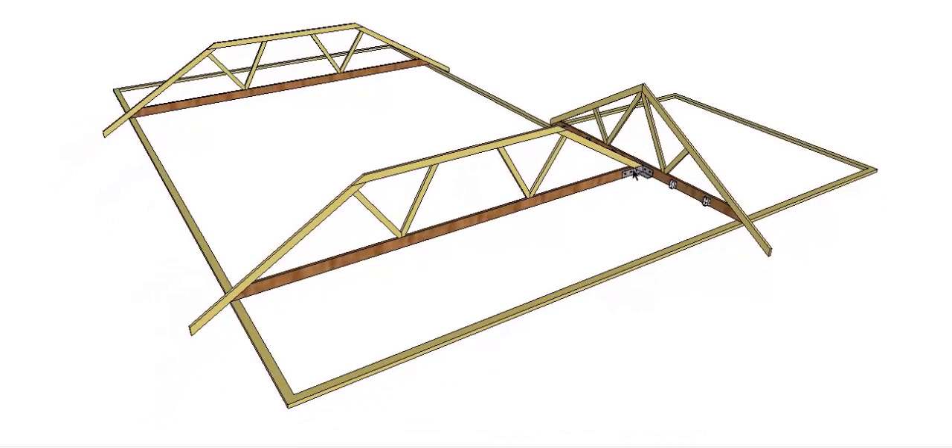That position is where your first truss goes. You can see it's sitting on the high load bracket there, and it's come in the same distance from the other end. These are both girder trusses as well because they're going to help carry the hip end of the roof. So that's our first truss — our truncated girder sits in there, equal distance, parallel to the end of our wall. Obviously these trusses are all going to need to be temporarily braced as you build the roof.